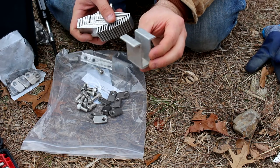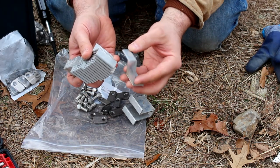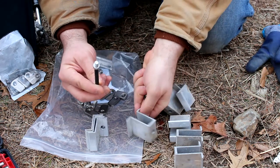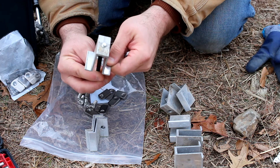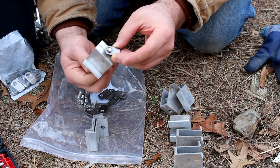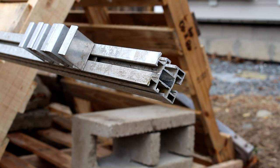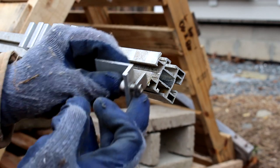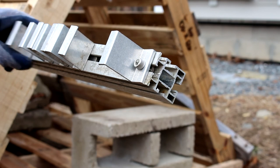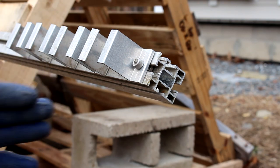These are mid clamps — they span between two panels — and these are end clamps. I was able to buy all of these as a set with the solar panels and rails. These are all used, all nine years old, but they're made out of aluminum. When I'm doing a mid clamp I'll hold it with the hex key like that so it doesn't slip off, then put the nut on. For this last one I'm going to turn the nut the other direction to get it in there. You can see that each panel is going to go in between these clamps, and I'll slide them down as I need them.